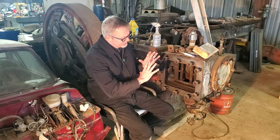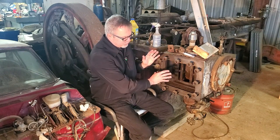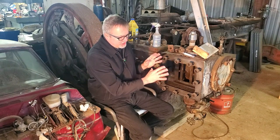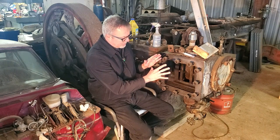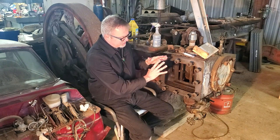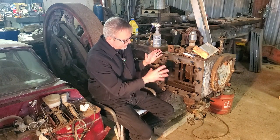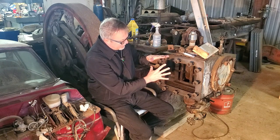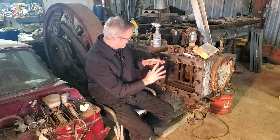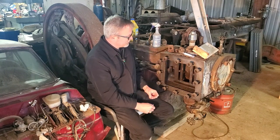It basically advances due to centrifugal action until it's regulating the speed, but if there's any change in flywheel speed, the position of that governor mechanism relative to the flywheel changes instantly because everything's spinning, and a body in motion wants to remain in motion. So that governor assembly is spinning, and if energy gets taken out of the flywheel, the position of the governor relative to the flywheel will change, and it will instantly affect the stroke of the valve and dump more steam in, bringing the speed back up.